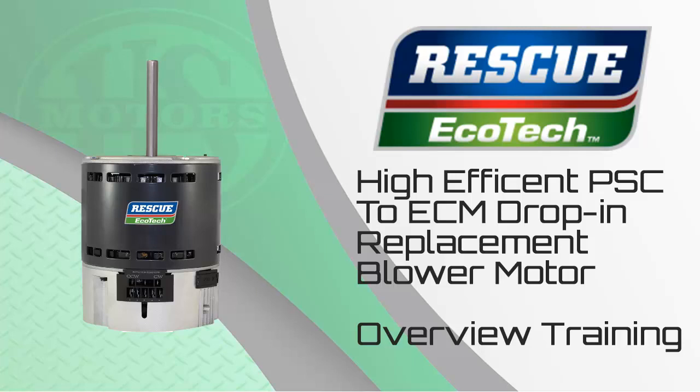The Rescue EcoTech was specifically designed to replace PSC or permanent split capacitor motors with a high efficiency ECM or electronically commutated product. In doing so, the homeowner system gets all the advantages of an ECM motor without the cost of changing the entire system.